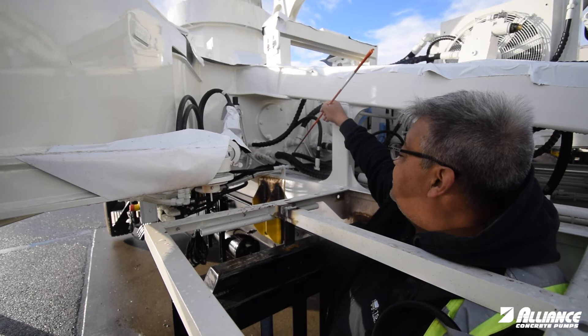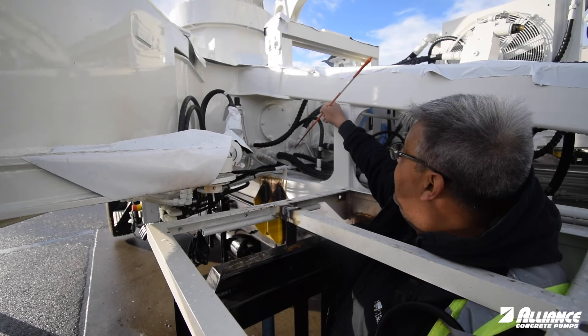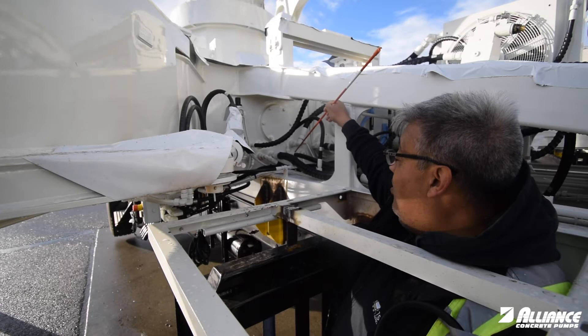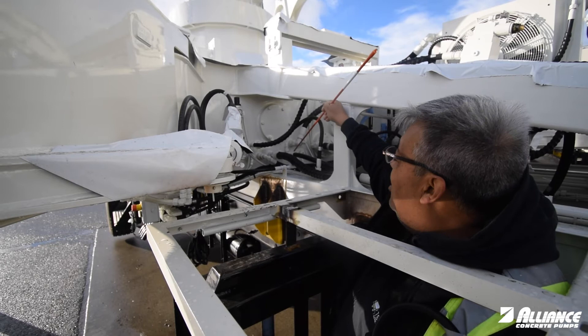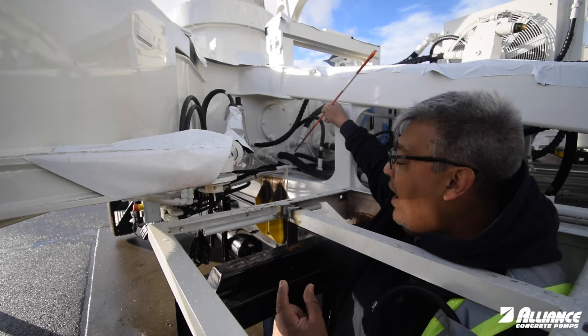They will always be identified by the particular plug for the 55 degrees. This is the old-style 90-degree sensor and temperature sensor combined — it's long, and you will be able to see how much it sticks out. In the older pumps, four or five years ago and back, we only have this one. In the old pumps you will have two wires going in: one for temperature on the wide terminal, and one for the 90-degree sensor on the narrow terminal.